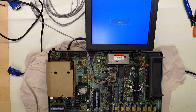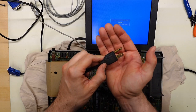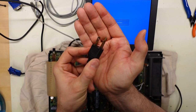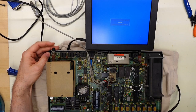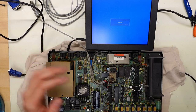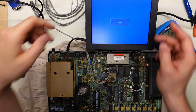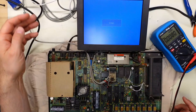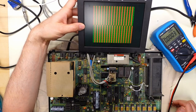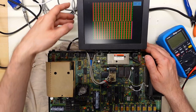That was anti-climactic. The plug is super gnarly and dirty looking. Let me clean that up a little bit. It's a low-current machine so it's not that big a deal. There's no power LED so I have no idea if this thing's even on. Let's get the multimeter — we're getting a nice solid five volts, so the machine is definitely turned on. But no picture. Maybe that's not the video output — let me try one of the other cables. Look at that — we actually have an image! It's a non-working computer but that is definitely composite video.